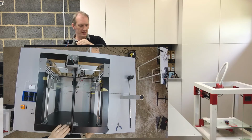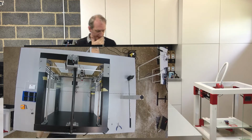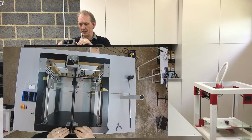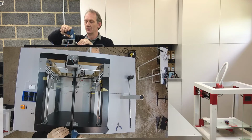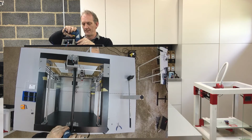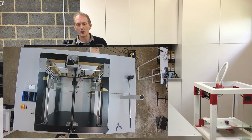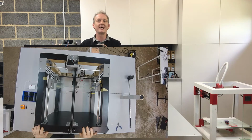That's that housed in. Then using the saddle, clip the saddle into place. Then the saddle screws, which are provided with most of the 20mm conduit saddles. Do that up. And there we have it. Nice piece of electrical conduit for all the wires to run down, keeping everything nice, clean, tidy and safe.